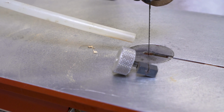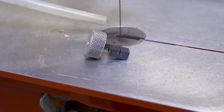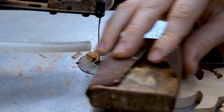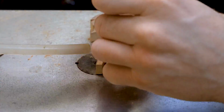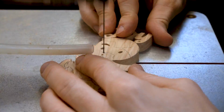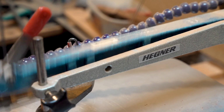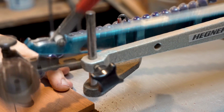And for those of you who do a lot of pierce work, you have the option of purchasing a quick release clamp. For any of you starting out, sometimes the vibration of any scroll saw can be challenging. You might find it physically difficult to perfect the action of holding the wood down with one hand and feeding it with the other. And again, there is an option to purchase an arm accessory that acts as a clamp, assisting you to hold the project down as you feed it through the scroll saw.